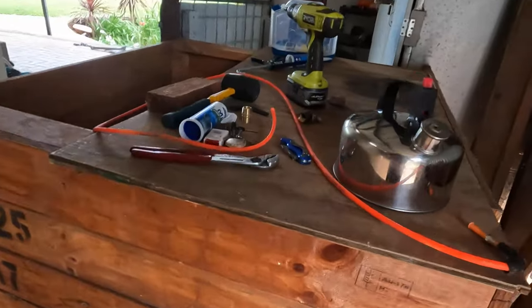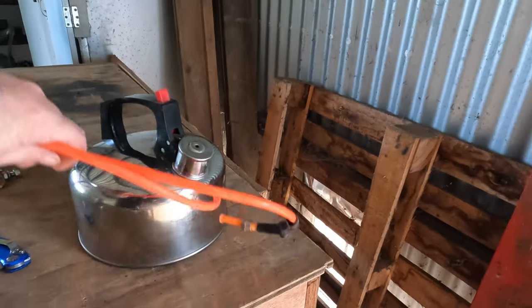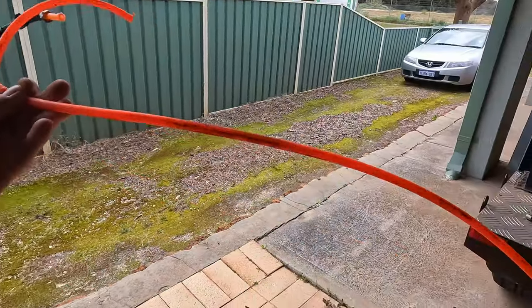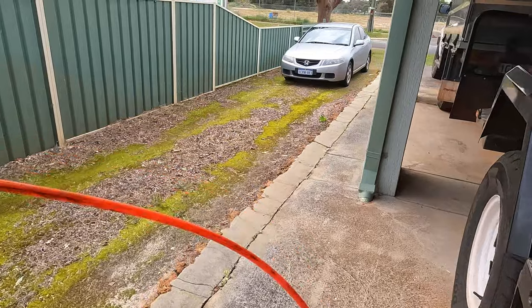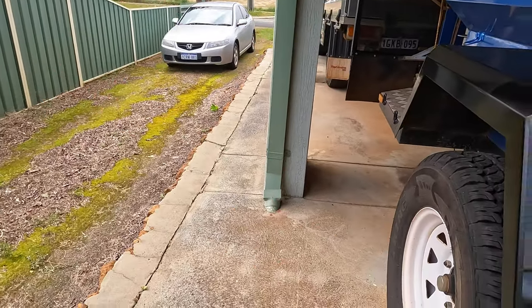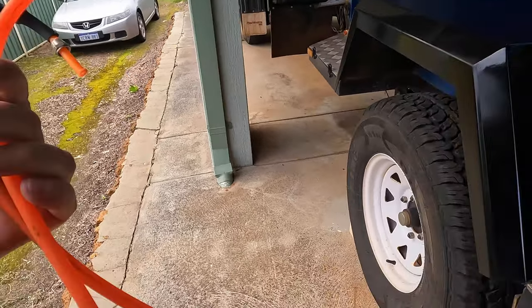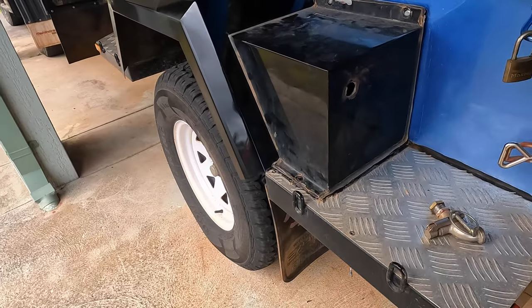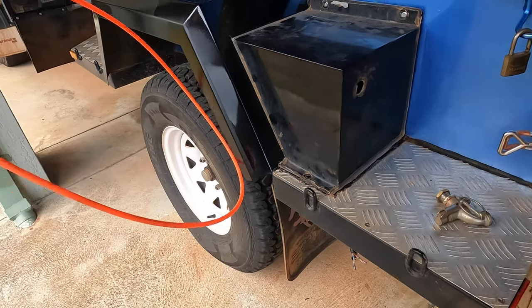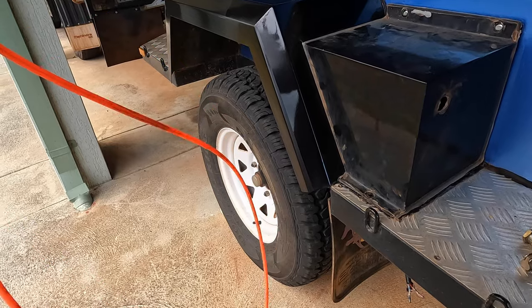the plumbing they used was this, I think it's an air hose type cable. And that went all the way up through the chassis, and you can see how small it is, okay? And the inside diameter is even smaller. So it wasn't letting us get much of a flow because of the friction involved, and that's probably close to 1.40 meters there in my hand.